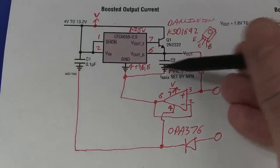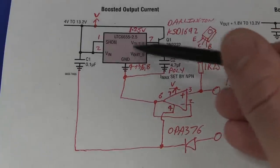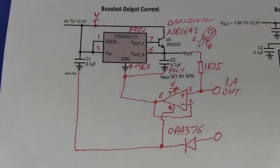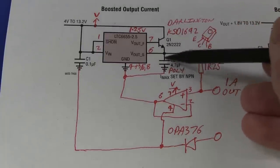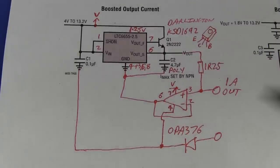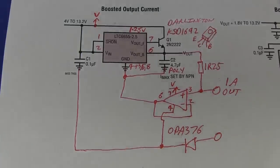You've also got to have a minimum output capacitance for stability, because a voltage reference has an internal error amplifier. Error amplifiers — just like linear regulators and LDOs — can oscillate if you don't have the correct bypass capacitors on the input and output. That's why I wanted to breadboard this thing up. I had a funny feeling it's in the datasheet and it should just work — but does it? Let's find out.